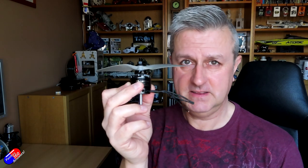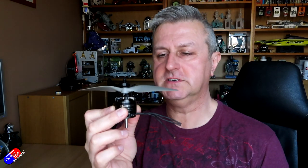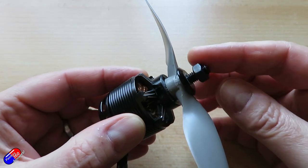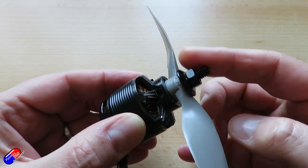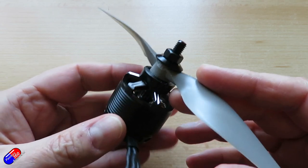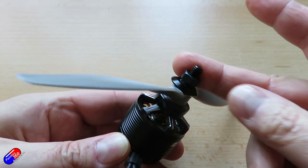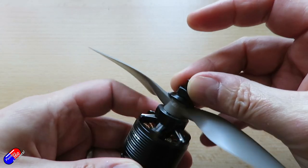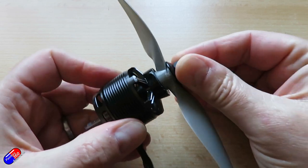So let's start with the basics. Before multirotors were a glint in our eye, this kind of electric motor setup is the default way everything worked. The way that the nut goes on top of the motor uses a standard right-hand thread, exactly the same kind of thread on the common nuts and bolts you'd find at your local hardware store. The prop is designed to turn in the opposite direction, and that means that when the motor is spinning, the nut is always being tightened up.